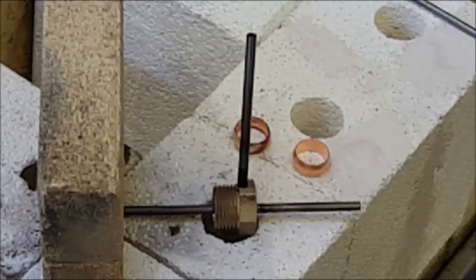There's obviously a pair of these on a reactor tube. Just behind you can see the two copper olives — as they're called, the o-rings that fit onto the reactor tubing — and I'm going to get them red hot too. That's called annealing and it makes the copper really soft and malleable so it folds down onto the glass without leaking.